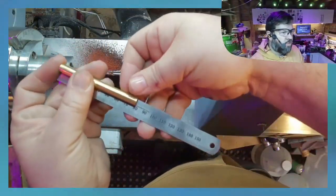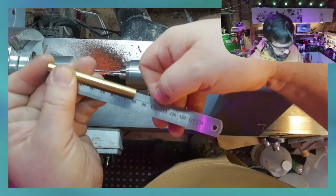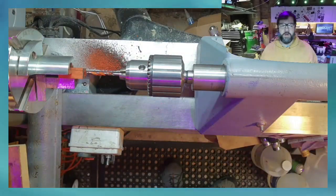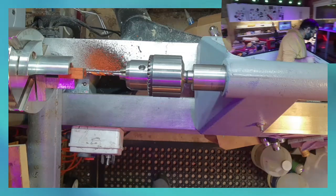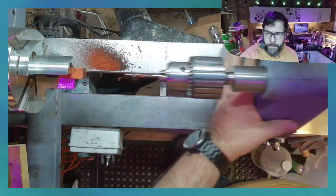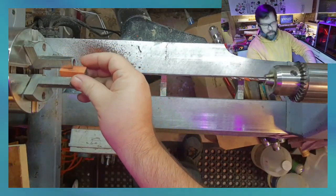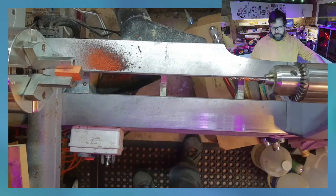So, the actual tube length is a hair under 80 mil. At about five, it would need about 85 mil travel, I guess, to do the longest of the tubes that I do regularly, in one go without resetting the tailstock. Yeah, 100 mil would be more than plenty.